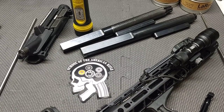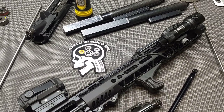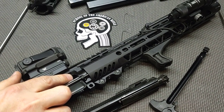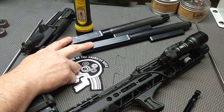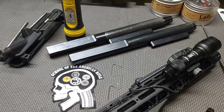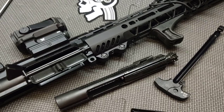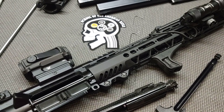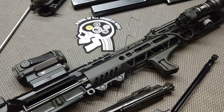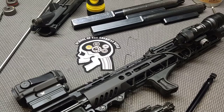Hello everyone, thanks for watching. This is part two of our PSA AR-15 pistol upper autopsy. The previous video showed that the barrel extension was damaged on the edges of the lugs. Using the Midwest URR and the two unique LSC barreling spud, we determined the barrel extension is clocked in this upper receiver, causing damage on the barrel extension teeth or lugs. We're going to follow up with more inspection on this upper receiver group to find out why there are accuracy and reliability issues.